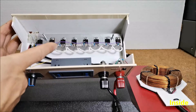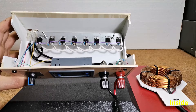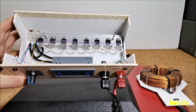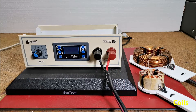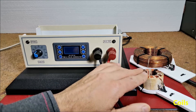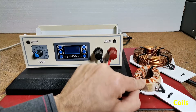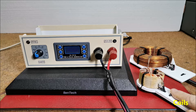The MOSFETs are mounted on a sufficiently massive aluminum cooler without insulation, because the drain electrodes of each transistor are interconnected. The interconnections should be made with suitable wire with a cross section of at least 2.5 mm, because a very strong current flows through them. Special attention should be paid to the construction of the coils, because the MOSFETs can burn very easily. That's why I made detailed drawings with the dimensions of the coils and the wire. Coils with other dimensions can be made, but some conditions must be met: the cross section of the wire must not be less than 1 mm, and the ohmic resistance of the coil must not be less than 0.5 ohms.